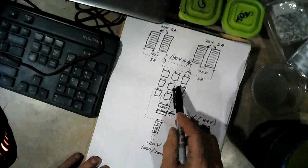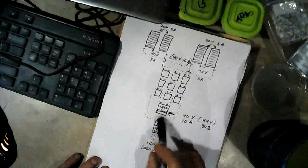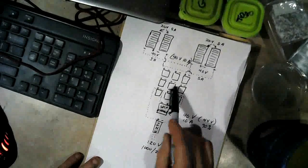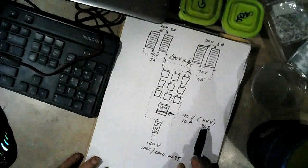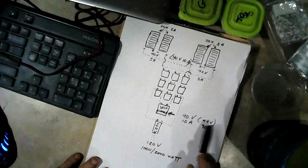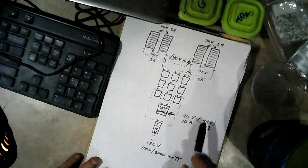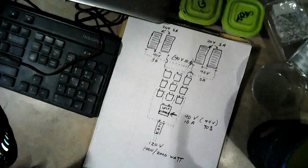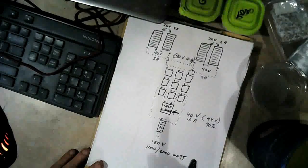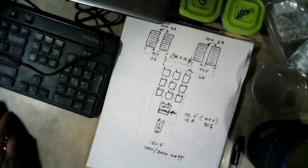If I take it to 44 volts, it charges back to 90% really fast. So I'll count on running it at 90%, which will give me 40 volts. That should give me a good charge going in. It's a very, very simple system — I like simple things. Everything I build, I try to make as simple as possible because it ends up being better that way. And that's my power system right there.